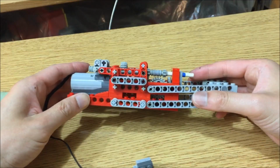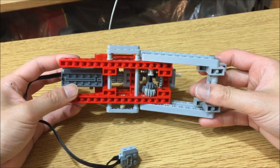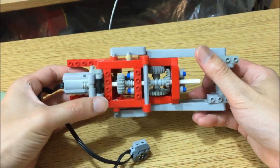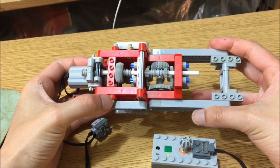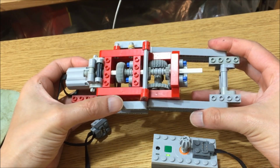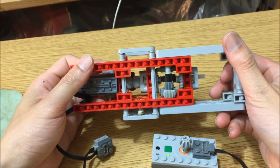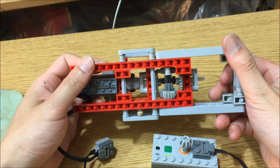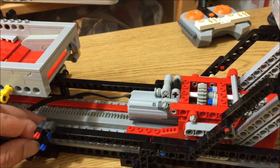Now we can look at the reverser itself. It is fundamentally a sliding shaft transmission with a single forward and reverse gear. The white drive shaft always spins the same direction, but the output direction varies depending on the engaged crown gear. A series of levers move the shaft when they come into contact with the bumpers at the ends of the travel.